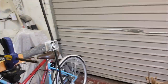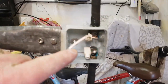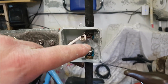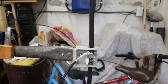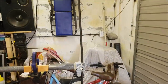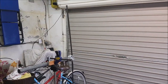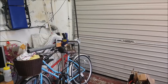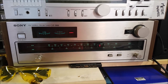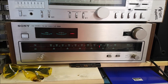So basically what we did was cut the pipe to 2.38 feet. An important bit is to leave a gap of at least 25mm between the two elements, or it won't work properly — you'll have interaction between one and the other. I'm hoping once we get this up on the chimney I just need to get a roll of 75-ohm coax so I can run a lead down from there to here and get it plugged into this old tuner.